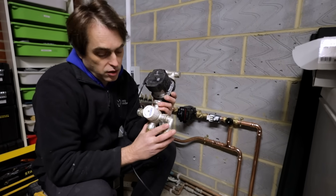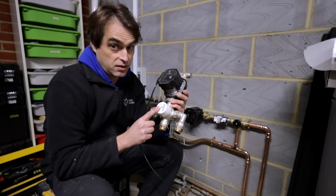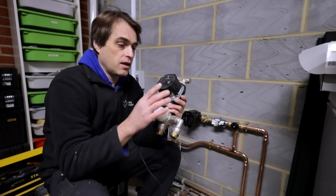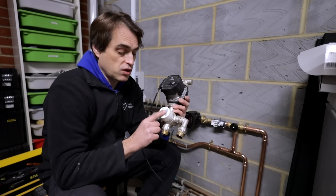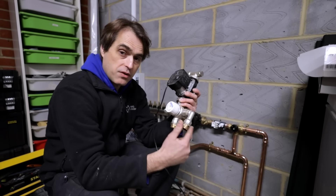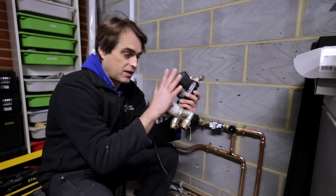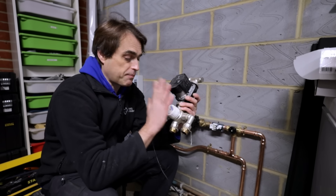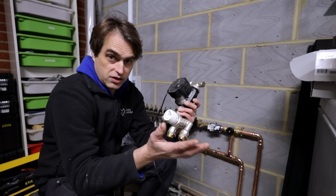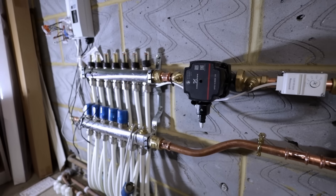This is what you normally see on manifolds, and 99% of underfloor heating gets installed with these fixed temperature manifolds. Please stop doing that if you can. If you have a boiler that can do electronic mixers, you really shouldn't be installing fixed blending valves anymore. This fixed temperature manifold requires very high temperature from the boiler — let's say 60-70 degrees — and it's blended down at the manifold. There's absolutely no need to do that anymore because it's inefficient and not that comfortable for the customer if you run it on on/off controls with tons of actuators.